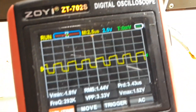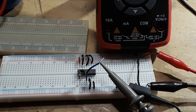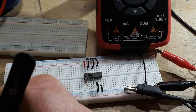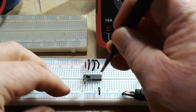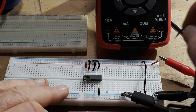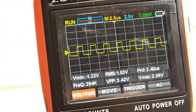Now if we take a look here, we don't have a beautiful square wave — we have a nice square wave but not a beautiful one. So we can use everything we have here and make it a little bit better. All we need to do is pull out our output line and jump the output of 2 to the input of 3 — that's what that little jumper wire I just put in there does. Now if we come over here and take the output and look at our square wave, it is much better. It's still not perfect, but it's much better.